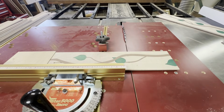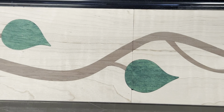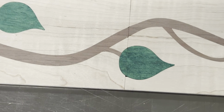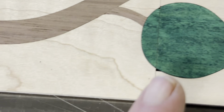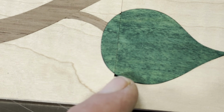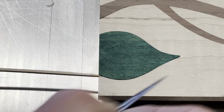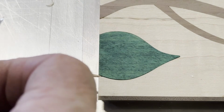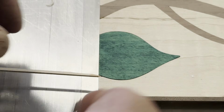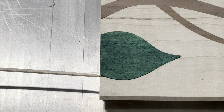Got a little bit of damage when I cut the box sides apart. You'll see a spot that I'll zoom in on in a second where some of the wood just chipped out. And I think what's going on there is I just didn't have any glue right in that spot, and so the wood was really weak there, and it got torn apart in the table saw blade. I had a couple other spots that did the same thing, and I think the message there is to make sure you've got everything glued in really carefully and not any spots without glue. But I was able to fix it, just made a little splinter and stuck it in there.